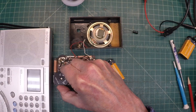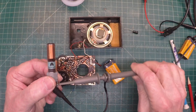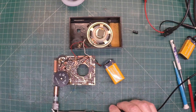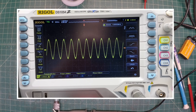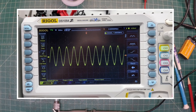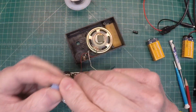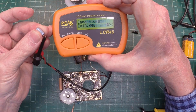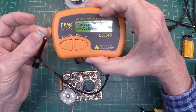And there's the oscillator. Let me look at it on the scope as well — just using a coil from my grid dip meter, 0.7 to 1.6, put it here in close proximity to the receiver. You can see the oscillator is working just fine now. Just a little 33 microfarad cap — let's check it real quick just for giggles and see what it reads. Around 15. I'm sure it's very leaky as well.